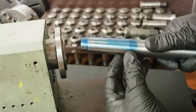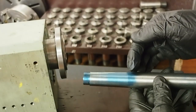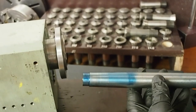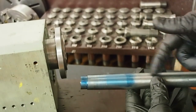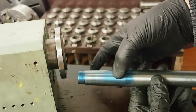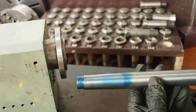That taper is polished up really nicely — I've now got pretty even contact throughout. I could cut it down a fair bit smaller to get more insertion into the headstock, although to be honest there's not going to be any loads on it other than a dial test indicator running along it. So I think I might try it just with this as it is. Next thing to do will be to turn down the outer diameter to size and see how well it works.